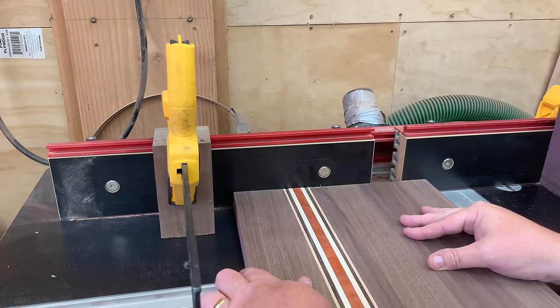Next I'll put up a screenshot of the exact size of this little juice groove template or jig, and you can copy down these numbers and make one for yourself. Each dimension is critical — it has to be exactly the same length, width, and thickness, but you can glue and laminate up pieces to achieve that exact size. You might have noticed that I'm using the words 'jig' and 'template' interchangeably. They are in fact different things: a jig is a type of tool that controls the position or movement of another tool, while a template is a form that has the finished shape and size built into it — often looking exactly like the finished product for copying identical parts. In this case our tool contains part of the finished shape and size within its form, therefore it's also a template.